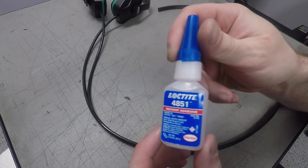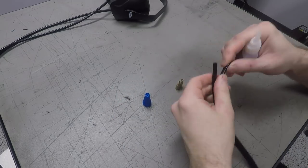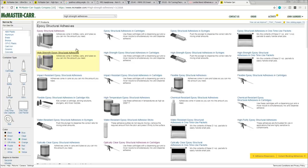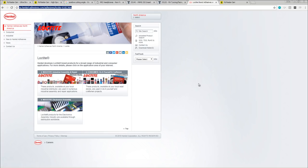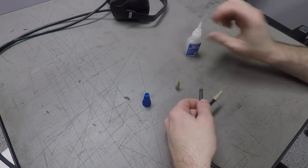This happened to match with the Loctite we were using in our Loctite superglue video — card to that video here. Quick piece of advice: if you're ever struggling with adhesives, two websites to use. First is McMaster-Carr — they've got phenomenal information on many different types of epoxies and adhesives. The other is the Henkel or Loctite website; they are a surprisingly phenomenal company with really good tech support and even engineers responding. In this case we had a quirky requirement because PEEK generally doesn't adhere very well, going into plastic tubing, and we wanted it to last without an adhesive that would cause the tubing to melt or long-term corrosion issues. The Loctite 4851 worked great and is very secure — so secure we barely got the second one on all the way before it started to cure and set.